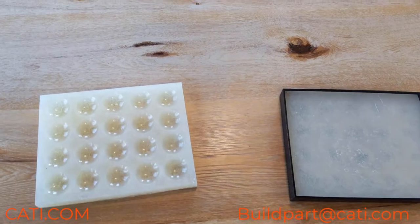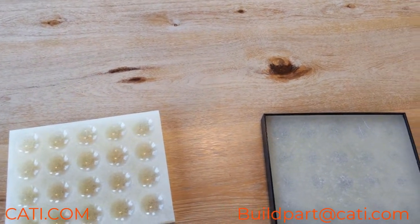It was a really quick and easy thing to do. We designed it in SolidWorks, brought the file into GrabCAD, and printed it on our J-series, which is the PolyJet machine, in Vero Black. We printed it with the glossy finish so that we didn't have to do any post-processing — other than just cleaning the part. We poured it with a food-safe silicone material, and then poured chocolate into that mold we created. It was a great process.